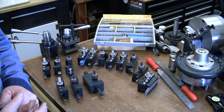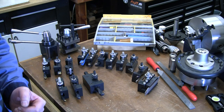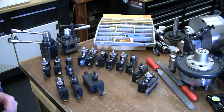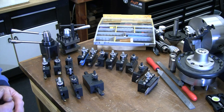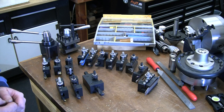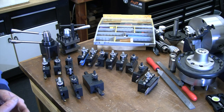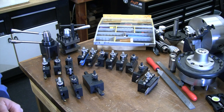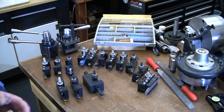Make sure you have a goal going into planning your tooling. My goal was to do the majority of turning with indexable carbide inserts while minimizing the number of different insert types. Any time I look at buying a tool holder, I make sure I understand what insert it takes and not just the initial cost — a lot of times a holder comes with inserts, but the real cost is what quality inserts you can purchase for it in the future. Think of it like printers and ink: the printer is cheap but the ink cartridges are expensive.